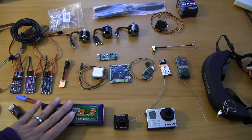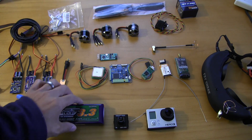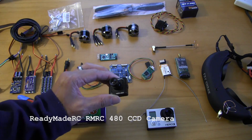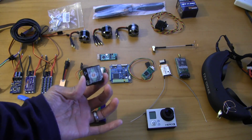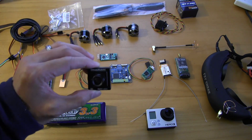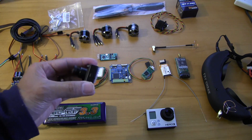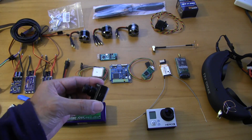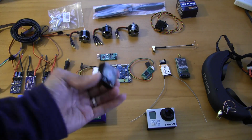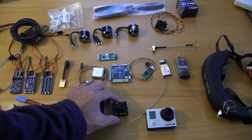We're going to be powering this off a Nanotech 3300mAh 35-70C battery — you can get these for about $27. I'm also using a ReadyMadeRC 480N camera. It comes with the configuration buttons on the back. An interesting note: these come with wide dynamic range and backlight compensation off, so one of the very first things you do when you get one is configure and turn those on — it's going to be like somebody turned the lights on. Excellent cameras, really great value, and a great company — I can't say enough nice things about ReadyMadeRC.